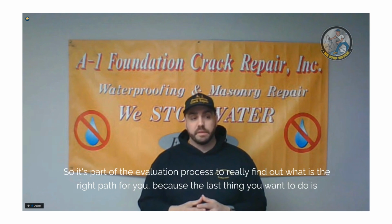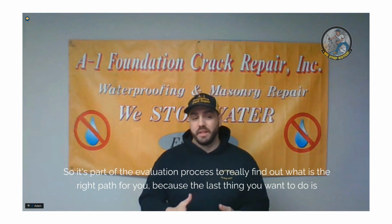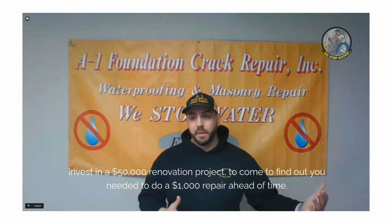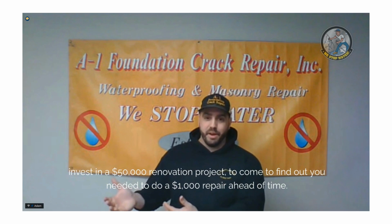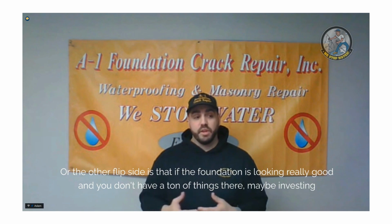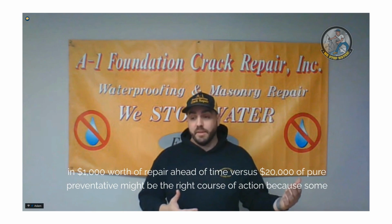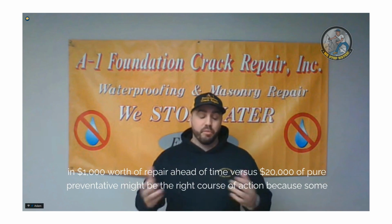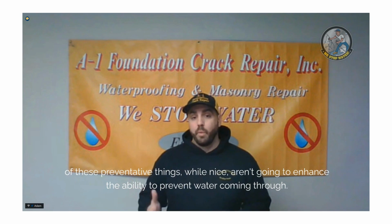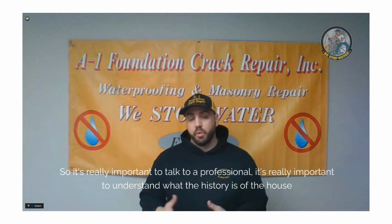So it's part of the evaluation process to find out what is the right path for you, because the last thing you want to do is invest in a $50,000 renovation project only to find out you needed to do a $1,000 repair ahead of time. The flip side is that if the foundation is looking really good, maybe investing $1,000 in repair ahead of time versus $20,000 of pure preventative work might be the right course of action, because some of these preventative things, while nice, aren't going to enhance the ability to prevent water coming through. So it's really important to talk to a professional.